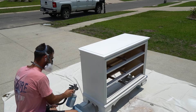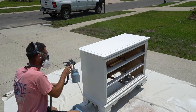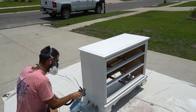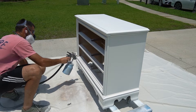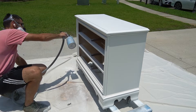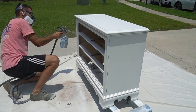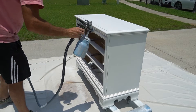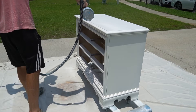One thing to consider when you're painting is that if you're doing work for a client, you really want to try to paint in a controlled environment. I'm not in a booth right now — I have used one before and I have sprayed inside — but depending on the circumstances I sometimes spray in different places. If you're using a turbine system and spraying outside, you want to bring everything inside as quickly as you can so it has time to level out.